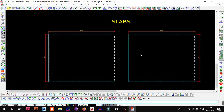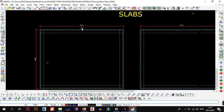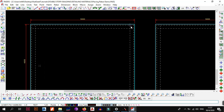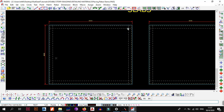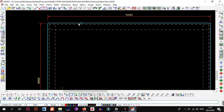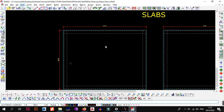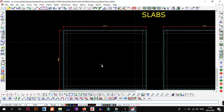Placing rebar using ProCon PADS is quite simple. To give you some context: the blue lines represent the edge of your concrete — we have a 5×4 two-way spanning slab. The yellow lines represent the cover lines, in this case offset 50mm inward, and the gray lines represent the supports underneath the slab. Bars are supposed to terminate at the yellow lines; we don't want any bars beyond them. The first thing you need to do is create construction lines — you can create as many as you want, placing some in the vertical and some in the horizontal direction.